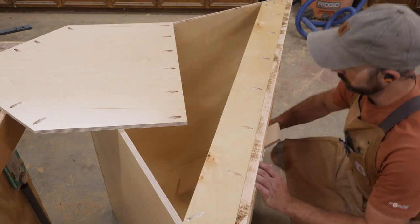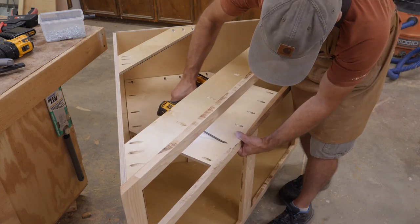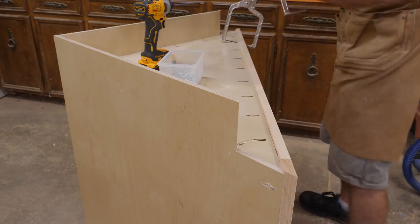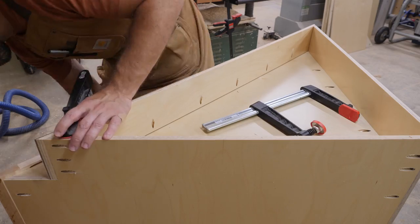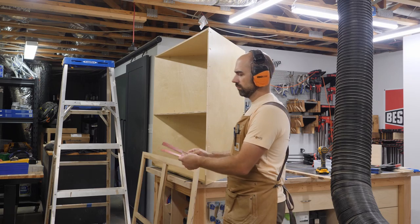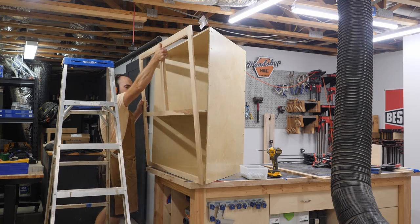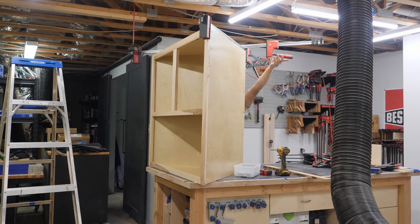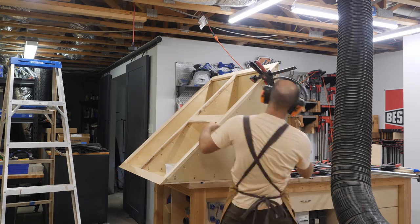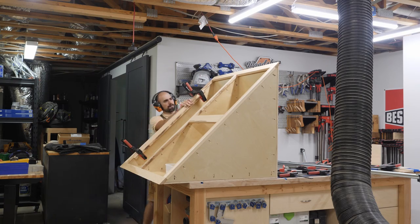With the sides attached to the face frame I now install a support piece that the drawer slides will attach to. I use a pair of spacers in the back of the cabinet to hold the piece flush with the top of the middle rail while I screw it to the face frame and carcass. I then flip the cabinet over to finish securing the face frame to the carcass. I also use a couple of clamps to hold the toe kick in place while I secure it to the cabinet bottom. To attach the face frame to the wall cabinet I prop the front of the cabinet up with some eighth inch thick shims and run a few screws to hold things in place while I get the clamps on. To secure the horizontal pieces I clamp a scrap piece of wood to the items being secured before running in the screws, which helps keep those pieces from flexing.